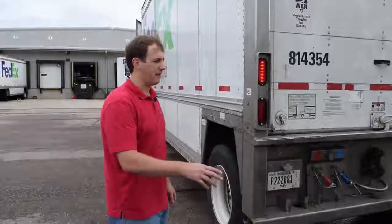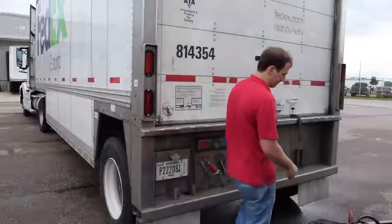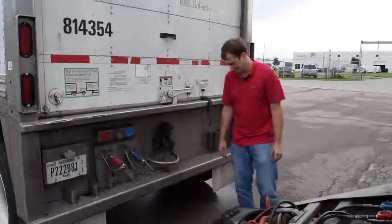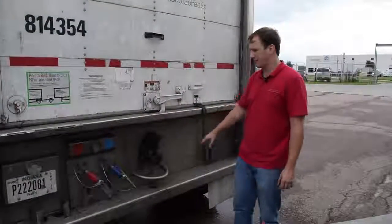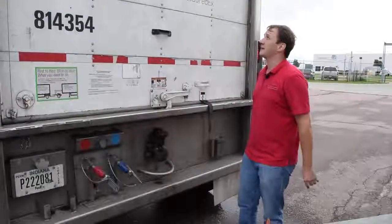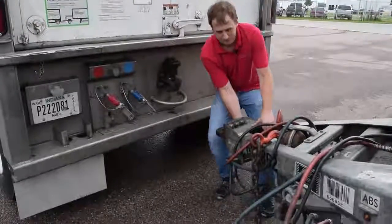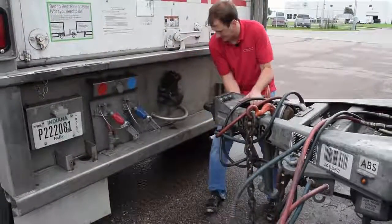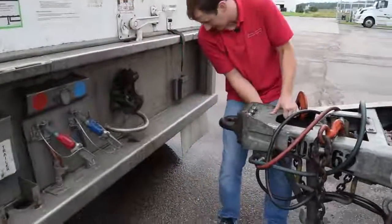After you position the dolly and position your lead trailer, you're gonna couple the dolly to the trailer. You gotta ensure that the trailer brake is set. That's the alarm that you hear. There's no emergency air flowing into the trailer. All you gotta do is just position the dolly onto the pintle hitch. Make sure your hands are not touching the tongue, because that's where it's gonna connect.